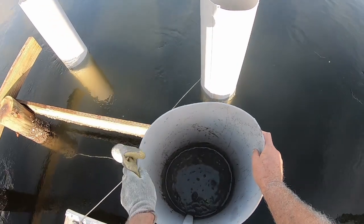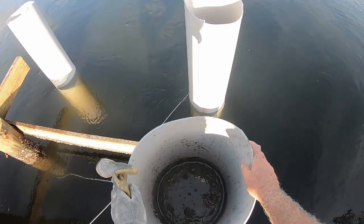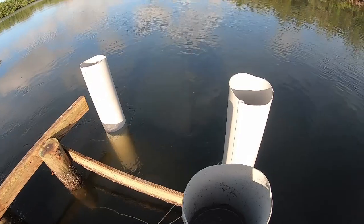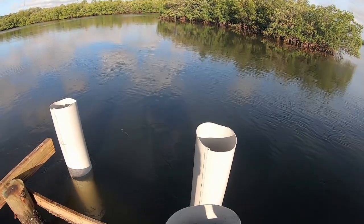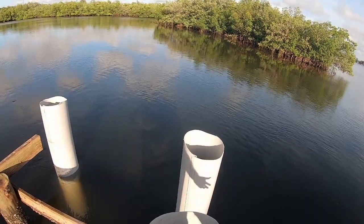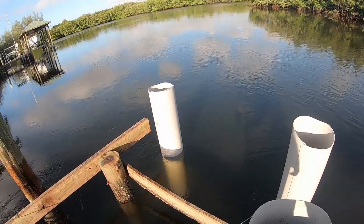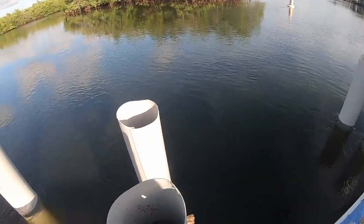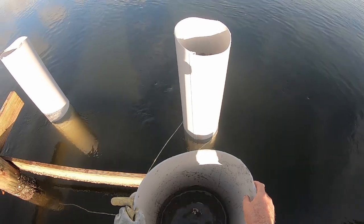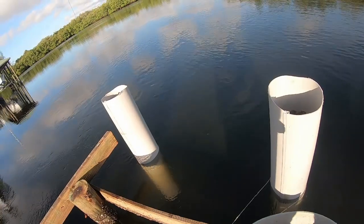I know that up north they add salt to cement to shorten the set time, I think it is. I can't remember now, I have to look it up. But in some instances they add sugar, which lengthens the set time, or vice versa, and then salt to make it go the other way. But I don't have a choice. This is just salt water, and this will set up, and this will be solid concrete around wooden pilings, and hopefully this will outlast me.